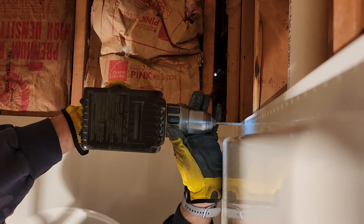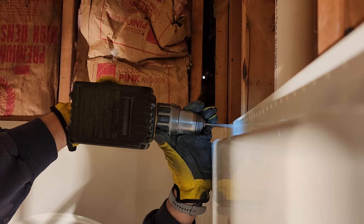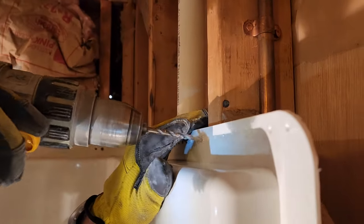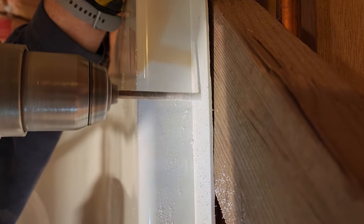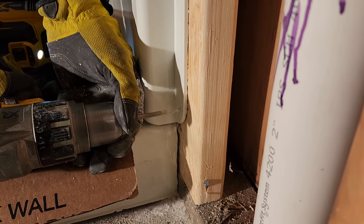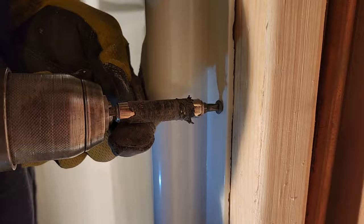Now that one side wall is in, you're going to do the same on the other side — pre-drill a couple of holes. There's a nailing flange that goes along the outer edge of the walls, and that's what fastens it to the studs. About every 12 to 18 inches, make sure you've got screws in. Remember, these shower units go in up to the two-by-fours — you don't drywall first. If you have an outside wall behind them, put your insulation in before installing the shower unit.